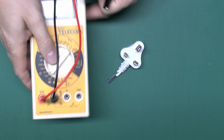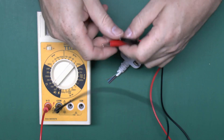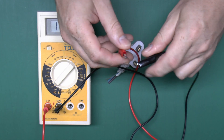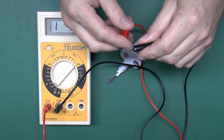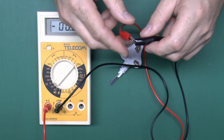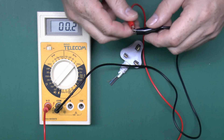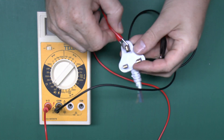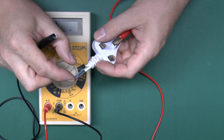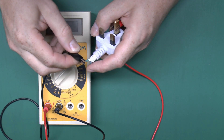What we'll use here is this multimeter, just to get some idea of the resistance. I've got it on the 200 ohm range. I'm not sure how accurate this meter is — it's a fairly old one with a British Telecom logo on the front, and they haven't used that particular logo since the late 1980s. So there we go — that's registering basically 0.2 ohms, which is just the resistance of the wires. So I'll clip onto the earth pin and onto this painfully thin bit of wire here, and we may or may not get some kind of reading.